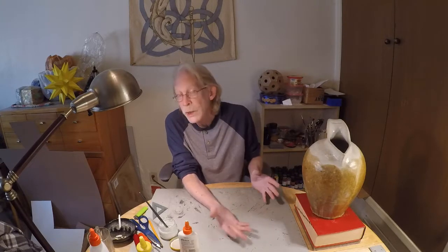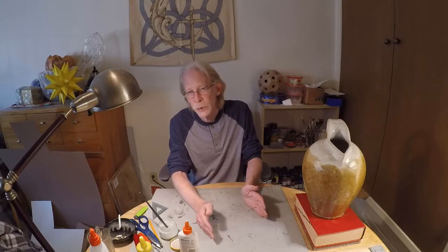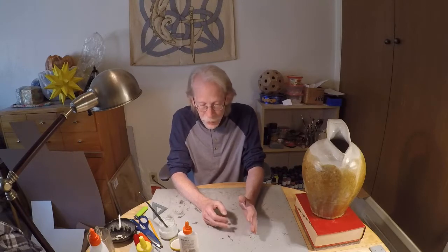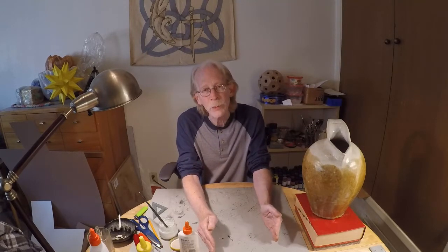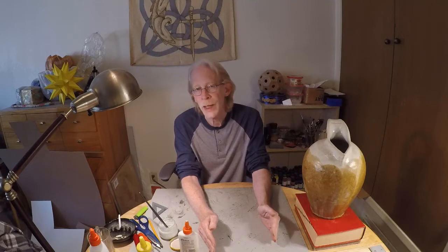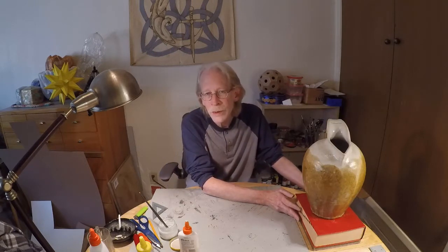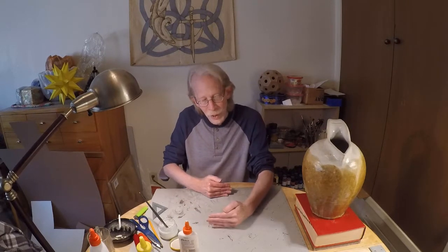If I was to just glue it and then leave it in the open, it would create a bow. You know, even if you turned it upside down, it would still bow outward because of all that moisture in there. It is going to be slightly concave at the end, which is fine. It's not so much as to distort it visually. The form ultimately will be flat and straight and will not have a bow in it, because after this is all made, the mechanism, I box it in. So when I box it in, we get straight edges and flat and square, etc.